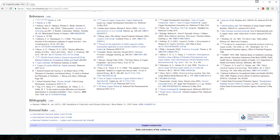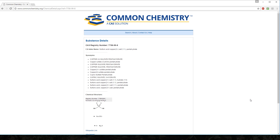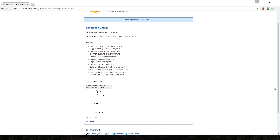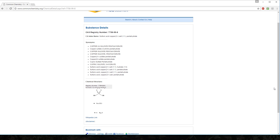For the Zep root kill, the reason you want to use it is because it contains copper sulfate pentahydrate — solid blue crystals typically used to break down feces in a septic tank or to kill tree stumps, hence the name Zep root kill. What we want is a copper sulfate sulfuric acid copper plating bath.